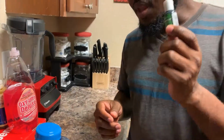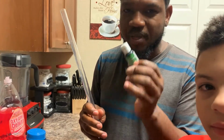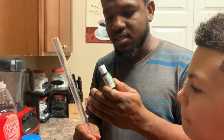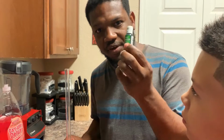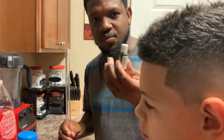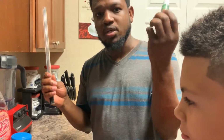It's gel, and for those who are concerned about it sticking to the surface of the acrylic, if you're using acrylic, it won't stick to the surface. Between the oil mixture with the soap, it just won't allow it to bond and settle to the acrylic, so you won't have to worry about staining. It does a good job of preventing it from staining. Also, I find the gel thicker and better for this type of application. Now, if you're running vinyl tubing, yes, it will stain the tubing, because vinyl absorbs liquid much better. But with acrylic tubing, it won't stain as much. It takes a long time for it to stain.